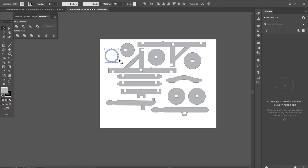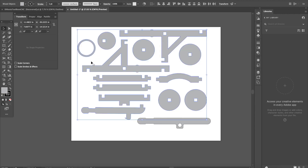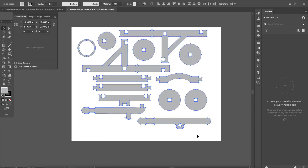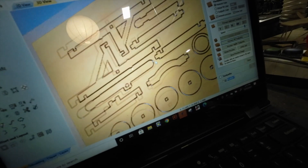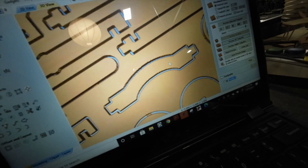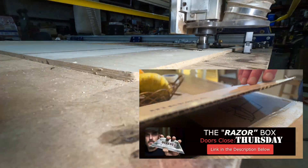Now I'm ready for the final layout on the CNC machine, just trying to make an economical layout. This doesn't take up much space — it's about 18 by 20 inches of material. I brought it into VCarve, did my cut path in VCarve, and here you see my preview in VCarve, ready to go to the CNC.